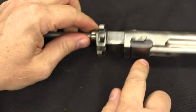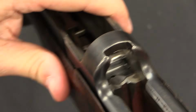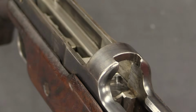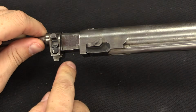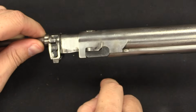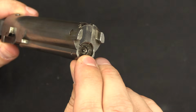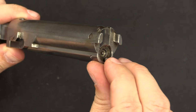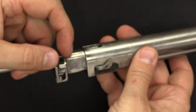But what happens, we have a locking surface in the rifle right here. If I move that around, you can see it a little better. This is exactly the space needed for the bolt. The locking block drops downward and is held in position by this piston being physically in its way. So then the firing pin right here hits the primer. Primer fires, cartridge fires. The primer then starts to move backwards. That pushes this piston backwards, and it doesn't have to move very far.